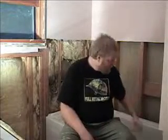Well, there we go. The tub is in its little spot. The anchors are in place, the brace behind the wall, the support is in place. Sits frickin' excellent. The only thing left to do is to connect the pipe down below to the drain. I actually have to go pick that piece up because we don't have one. So I need about 4.5-5 inches of pipe to connect that. And then we're good to go. We can actually run water in it after that. I connect the pipe, and after the cement dries in about 15 minutes, we can do that. But first, it's off to the local home improvement store.